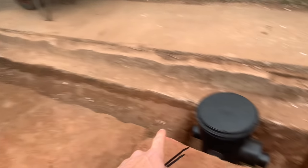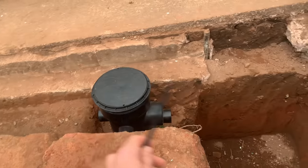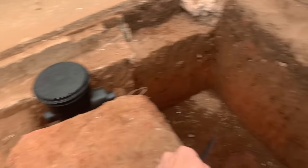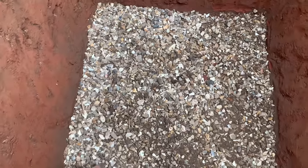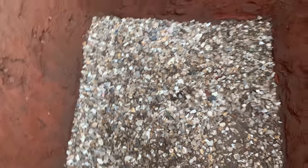Not really worried about connecting this up, but if I fill up the hole and get it ready, that water will just run in there anyway. So I want to get it done — if I can get this connected then I will, but this is the job tonight. I've got a few hours, just as well get it done. I just put about a foot of gravel in the bottom. Next job I'm going to put about half a foot of pea gravel in, and then I'll put the crates in.